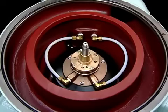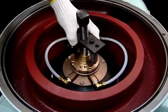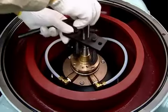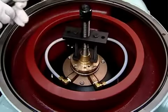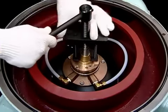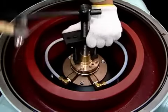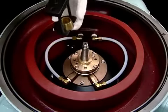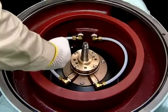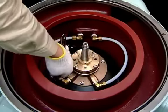This is the procedure for removing the water supplying device. Set the disassembly jack, push bolts and hexagonal bolts on the bowl bushing jack. Gradually tighten the handle to release the bowl bushing jack. Remove the cap nuts from the operating water inlet pipe of the water supplying device.